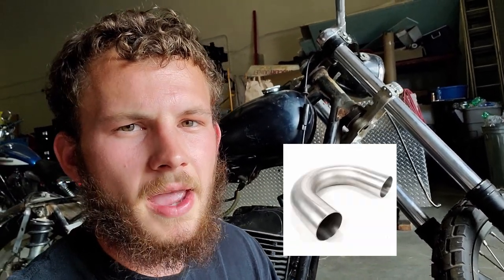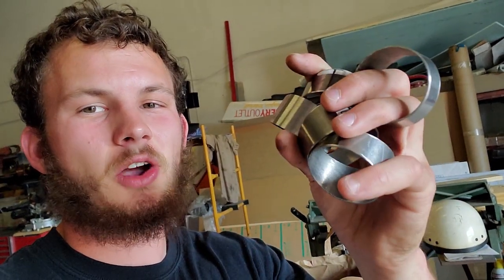There are two ways to get the pipe to come out of the exhaust port and end up ready to be expanded. The first way is with a pre-bent piece, like a mandrel bend or a sweep. The second way is to cut a straight piece of pipe at slight angles and stack them up backwards so they start to make a curve — these are known as pie cuts. Since I don't have access to a mandrel bender, but I do have access to a table saw, I decided to go with the pie cut route. It'll be a lot more welding and actually a lot easier to screw up, but I really want to practice getting these pipe welds down.